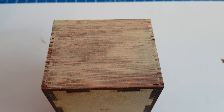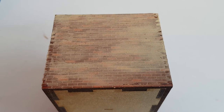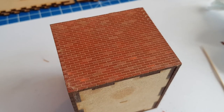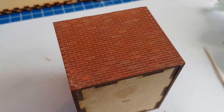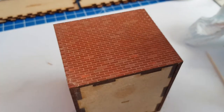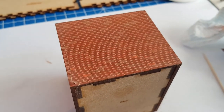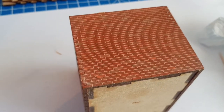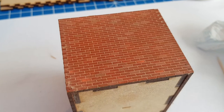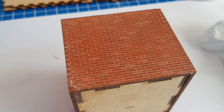That's the filler rubbed onto one side. I've used my finger to get into all the mortar cracks — I've missed a bit down the bottom so I'll add that. Once done I'm just going to wipe off with a towel. When cleaning the filler away in a downward motion, make sure you turn the kitchen towel over into a clean spot and continue until it's all done. I've then gone over with a wet finger to get rid of any overage, and if there's any in the corners of your bricks I use a little cocktail stick just to ease out any filler. Then go over with another clean piece of kitchen towel to finish nicely.